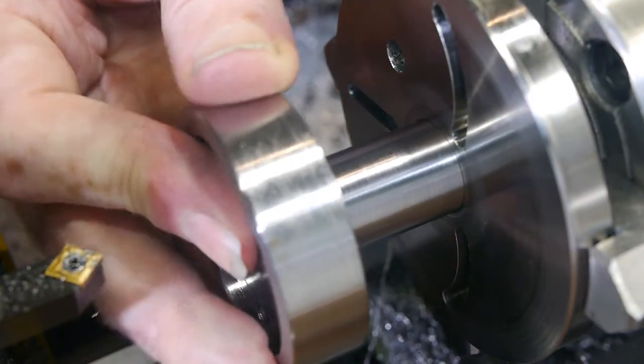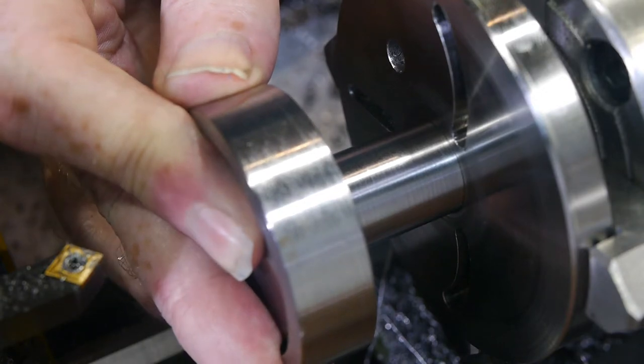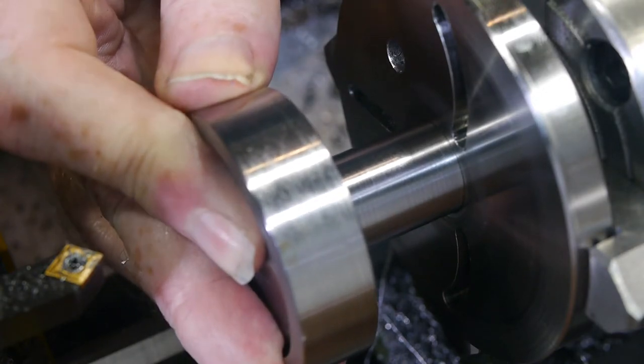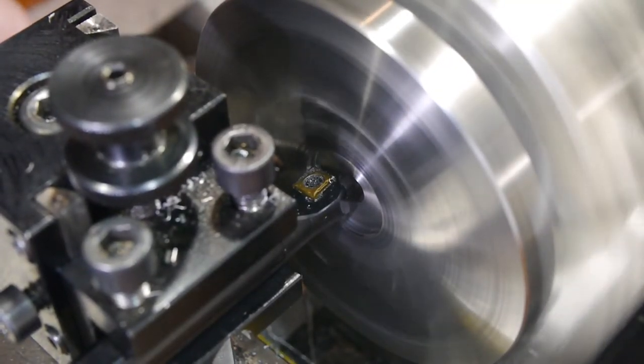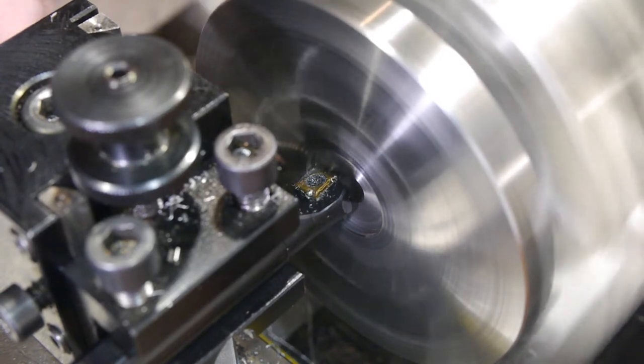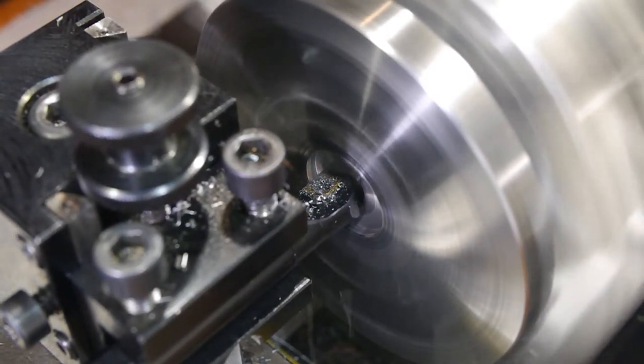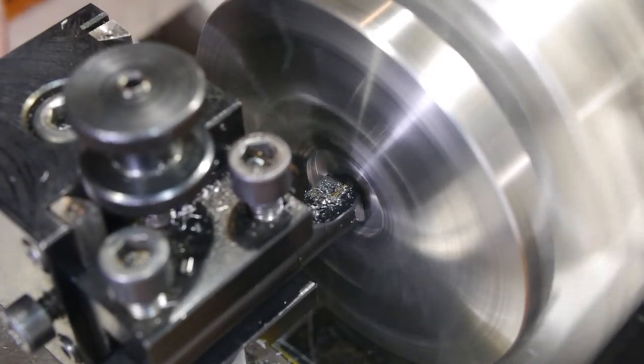The shaft fit very nicely inside the register, but wasn't sitting securely against the back of the pocket. It rocked, as if the surfaces were very slightly domed. I checked the flatness of the end of the shaft off camera and couldn't find any problem, so suspected the back face of the pocket was to blame. I cut very light relief on the inner half of the diameter to ensure the outer parts of the faces could sit securely together.